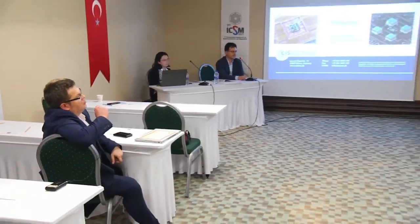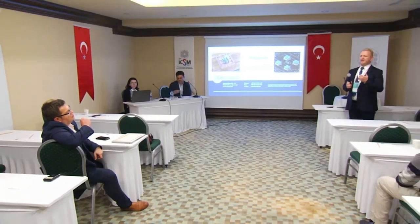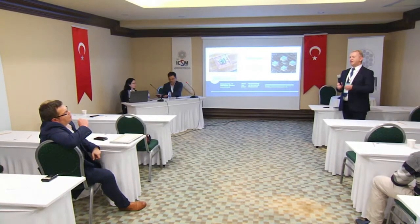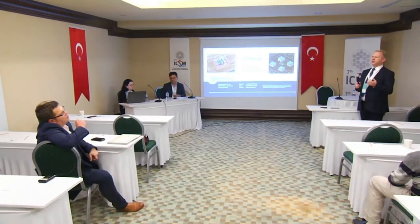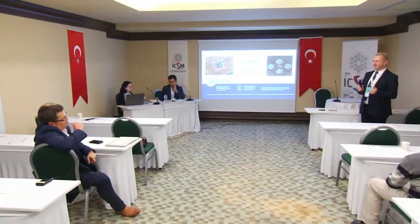We built already diamond-based sensors, but I would say this is like building a laser. This is a big pile of quantum events synchronized. So this is not a single NV center measuring. And the biggest advantage of, for instance, a diamond-based current sensor is that you don't need to calibrate this. You derive the current from very physical principles, and it's stable over the whole lifetime. Maybe it breaks, but it doesn't drift. And this is very attractive for industry: I have a sensor, and it's either working correctly and gives me the right number, or it's broken.